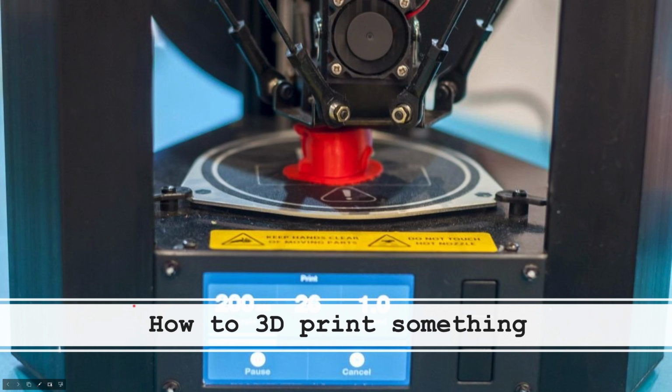I have a filament dryer. You can store it, or you can vacuum seal it to store it. PLA doesn't really have this issue, but ABS, PETG, all those filaments do get affected by humidity. PLA does too, but not as dramatically as other filaments do.